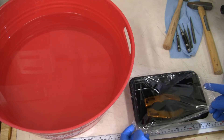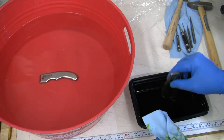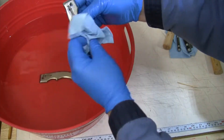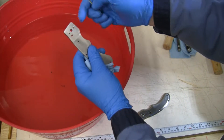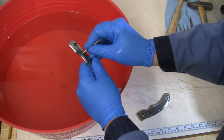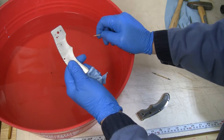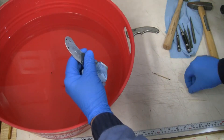It's been another 12 hours — let's see if we are broken tap-free. I'm being really careful as I pull these out, wiping off most of the ferric chloride to minimize how much I'm putting in the water. I throw those rags away, rinse my gloves, and make sure I get all that ferric chloride where I want it. I'll start with this one — it looked like it had barely anything left in it yesterday. And yes, it is completely clean through. Just amazing — just like that, salvage a part. It came out clean and we are completely tap-free in that hole, all the way through, not a piece left.